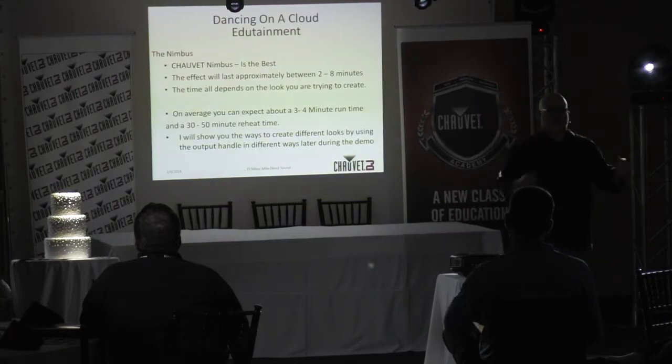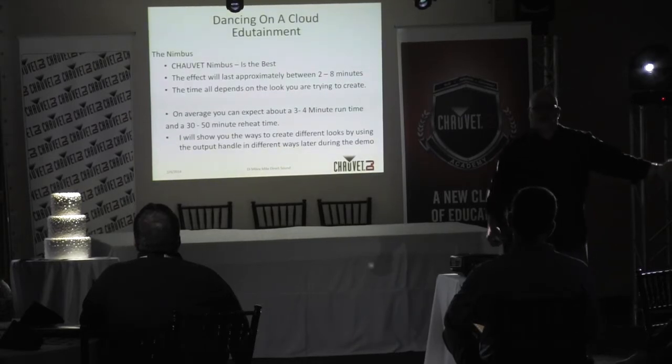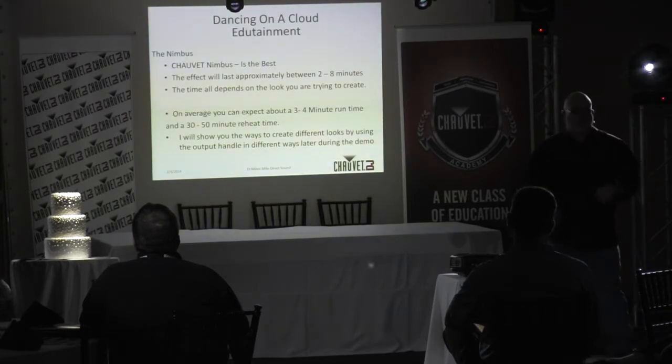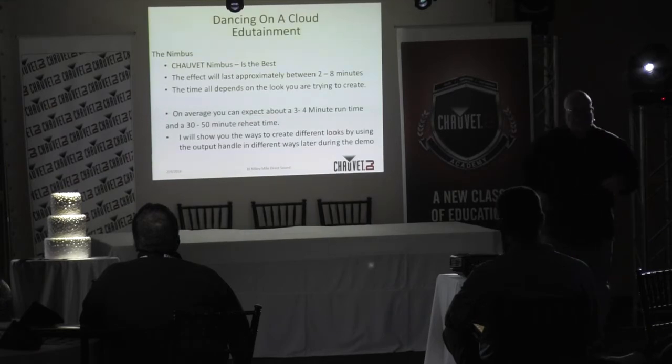The average heat up time for this, and most people, how many people have just normal wedding venues out there? They're not industrial style, just a normal banquet hall. Usually they have about 15 amp breakers on the walls, right? Along with the coffee pots and everything else plugged in them, right? So we'll talk about power management in a second. It takes about 30 minutes to heat up if you're using the double heating elements. It'll do it quickly, okay? I'll show you ways to create different looks with that.